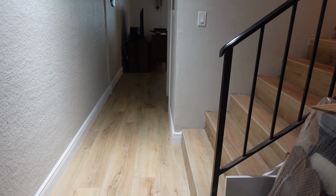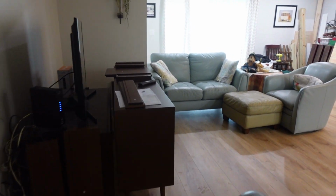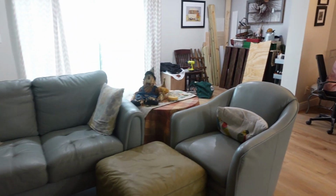So as we continue through the rest of the house, the floor, of course, is run my favorite direction, the way you walk into the room. I always like to walk down the planks, and then of course I like to have a light flow down the boards as well. So when I look into this room here, I don't want to look across all the planks, I'd like to look down it. And that's the same way that the light flows from the back of the house. So it's a cleaner, smoother look, and it actually makes the rooms look a lot bigger.